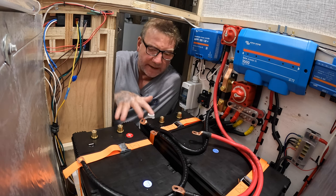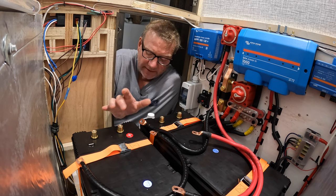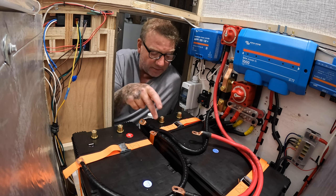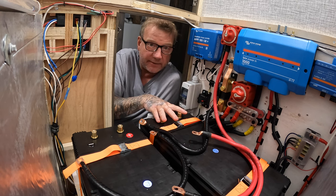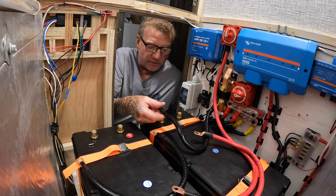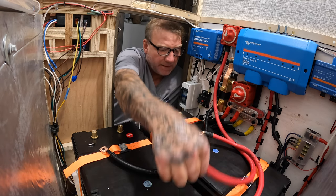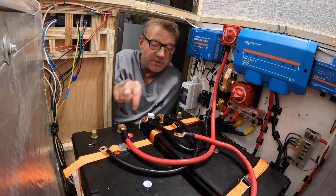When you're connecting more than one battery in parallel, the negative gets connected to the negative of that one and the positive to the positive. But when you come off these batteries, your positive goes to one battery and your negative feed goes to the opposite battery. Do not put your two main feed cables both on the same battery. My main negative goes to this battery, the jumper goes from this battery to that one, and my main positive goes to the positive on the other battery. The jumper will go between the two batteries — that way they share as evenly as possible.